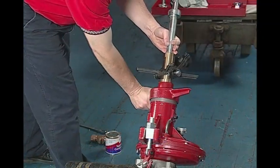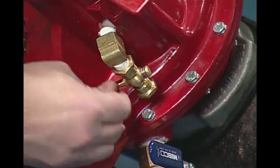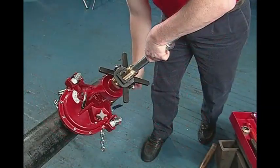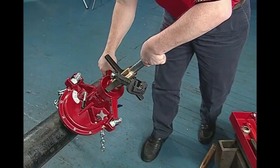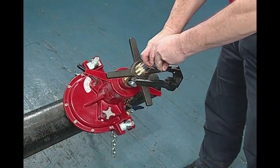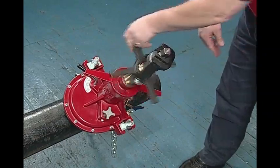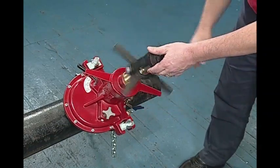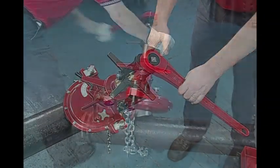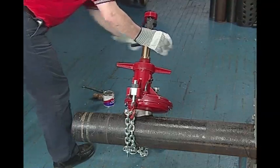Next, assemble the top and bottom halves. Verify that your swing valve is open, the upper ball valve is shut, and the pressure balancing valve with the star knob is also shut. Then hand tighten the boring bar top cap onto the top chamber. Push down the boring bar slowly until the bit touches the pipe. Snap the yoke over the bearing assembly and adjust the star feed as necessary. Place the ratchet wrench on top of the boring bar.